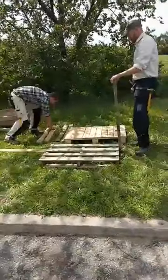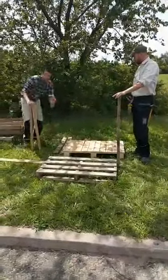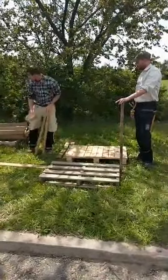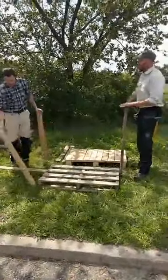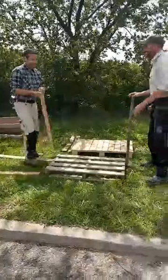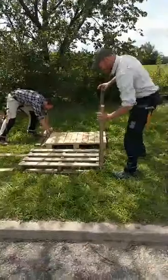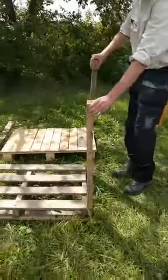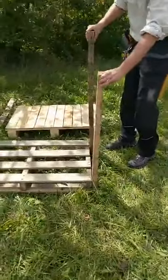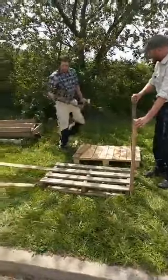Then we got these 2 boards, which you can see, I just cut 2 small pieces off of, which we'll put back in the wood pile there. We'll use those at another time. Don't throw anything away. Those are gonna go over there. Yep. And as you see here, we cut that a little bit shorter to create a pitch on the roof so that water runs off of it and not into our chicken food. And then these 2 pieces were a little special.